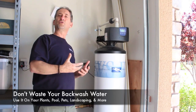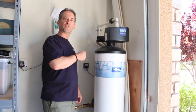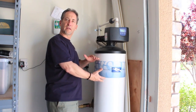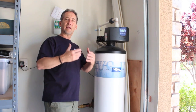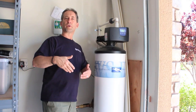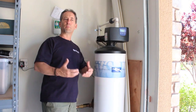The water I would ordinarily use for irrigation, I'm taking from my system self-cleaning and sending it to my plants. The reason for backwashing is important — it self-cleans the filter. You get longevity up to 10 years and actual quality filtered water. If you do not backwash the media in a tank, it will start to pack — think of it like an ant farm — and you get less and less filtration due to less contact time. Test results show filtered water quality goes down to 8%, 13%, 22%, while these systems continue at greater than 99% for solvents, dyes, fuels, chlorine, chloramine, and all those byproducts.